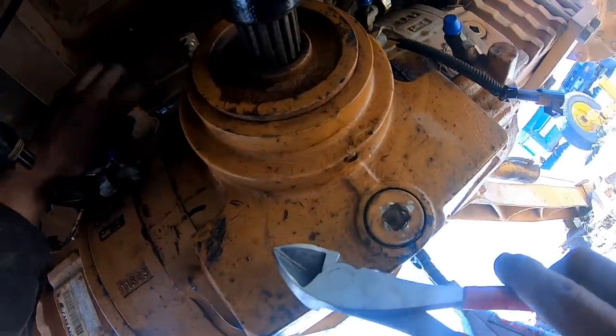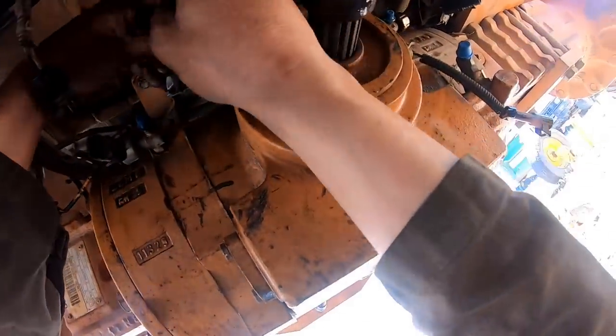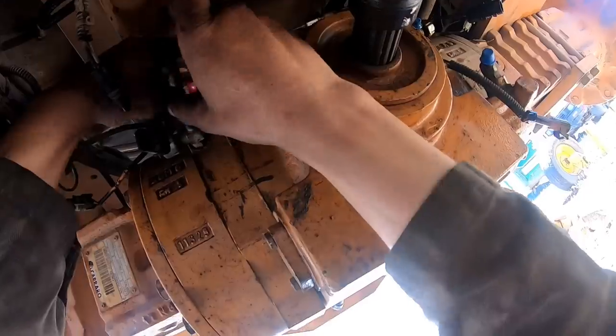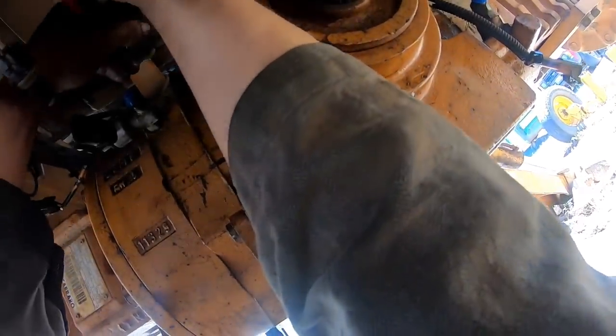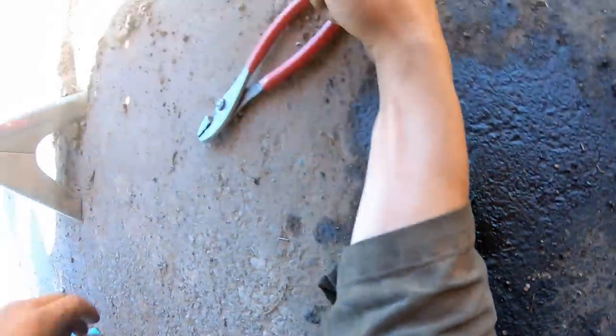I said, well, obviously you could tell that they must have had a problem with the wiring going into the cab to the house. So what they did, they were just tying wires together on the bottom to start it. They'd tie the fuel shutoff solenoid to power, and then they would just take another wire and jump over to the start solenoid and start it.